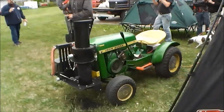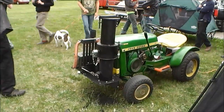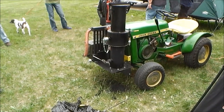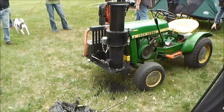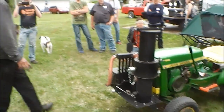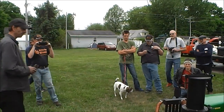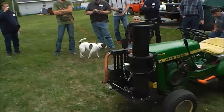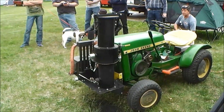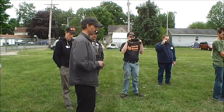We got a larger size one that we're running around the tractor with. This one's experimental — this is the M Series 2 prototype. We're gonna offer this one just like the little one with a stand on the bottom, but this has a more traditional filtering system. That'll be ran on a DC pump, but on this one we're using a smog pump to charge it. So it's an experimental blower system that we're playing along with. This will run on both wood chips and wood pellets.